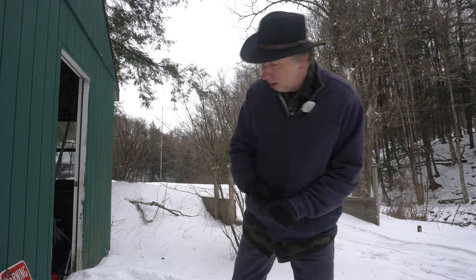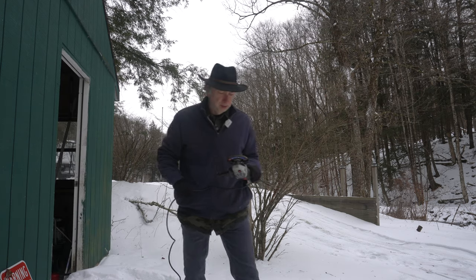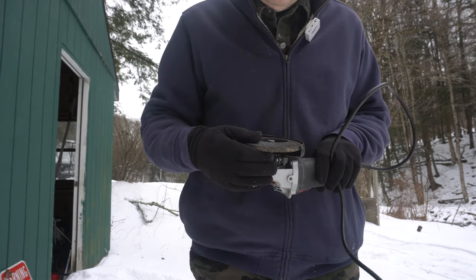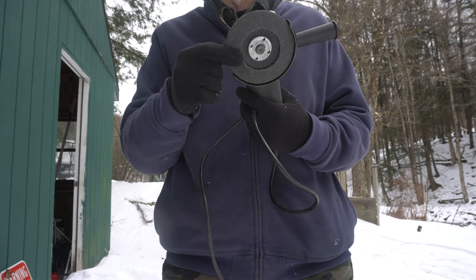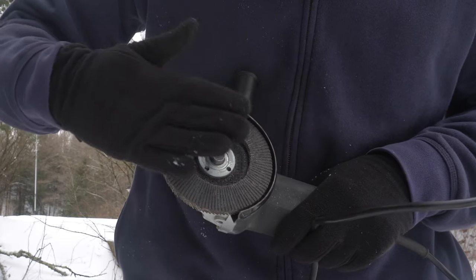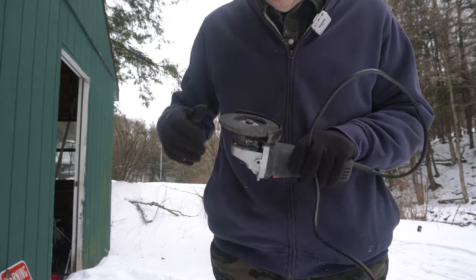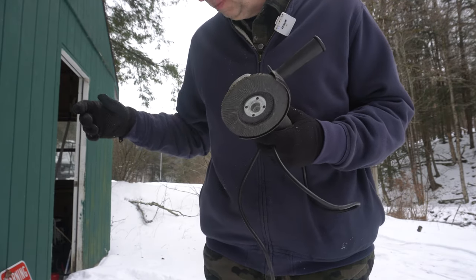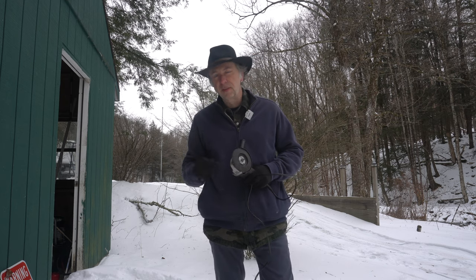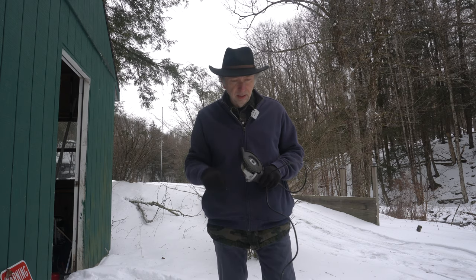What do you need for this? You're going to need one of these angle grinders — this cheap one is from Harbor Freight, but I'll link to two different ones in the description below. You're also going to need one of these discs called a grinding and polishing flap disc — basically layers of sandpaper on top of each other. I have an 80 grit here. I find that 80 grit takes the surface of the pan down really nice. Once we get all the rough stuff off, we're going to use a random orbital sander with a finer grit like 120.